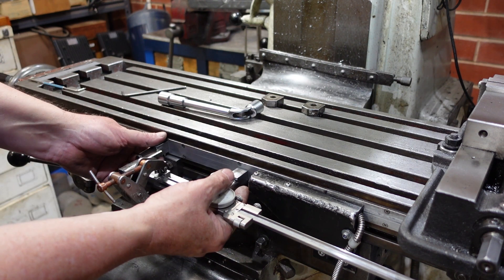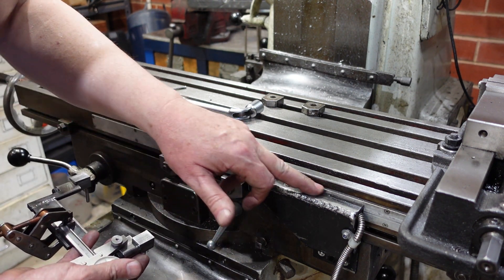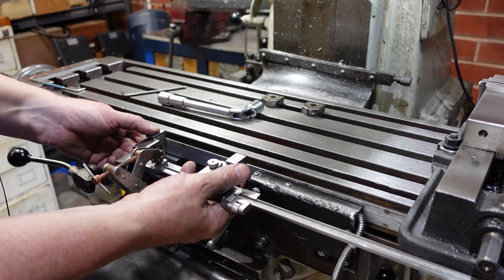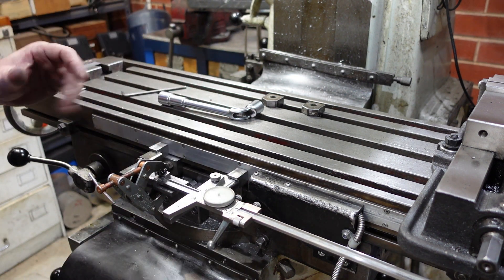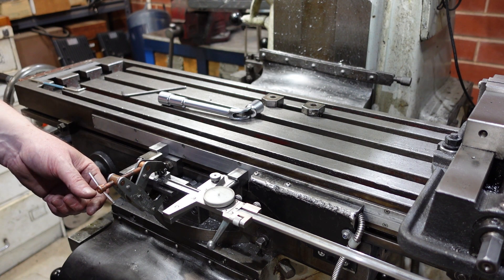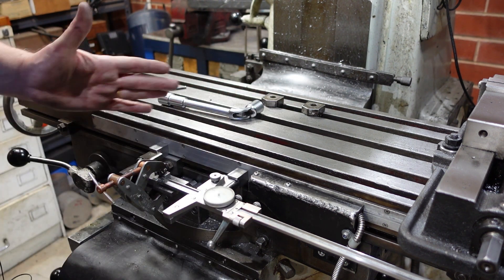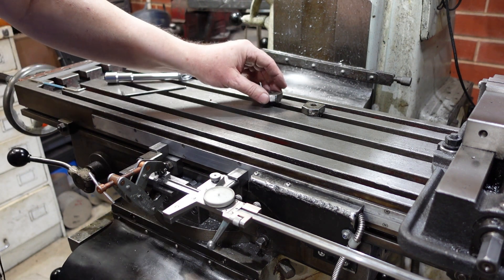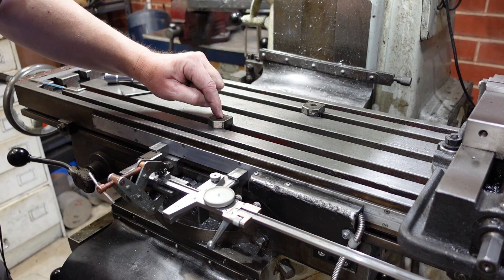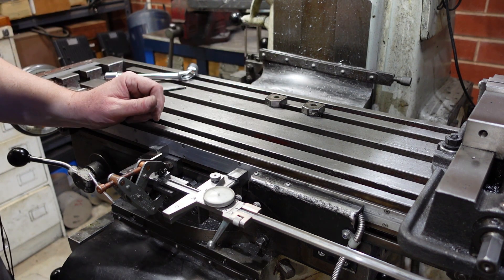One of the reasons for the pins was that once I've set it I can take that off so I'm not going to run into my DRO pickup. I hope this has been of interest — it's the sort of thing you could probably put on pretty much any mill that's got dogs, just one way of getting a more precise position. For example, if you want to start a slot a certain distance from an edge, you can run it in, see what the difference is, adjust this up, and then use the dog to stop. See you for the next one.